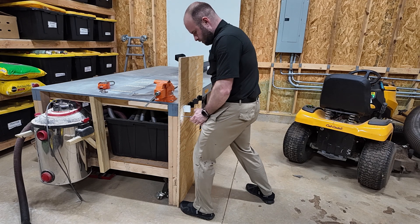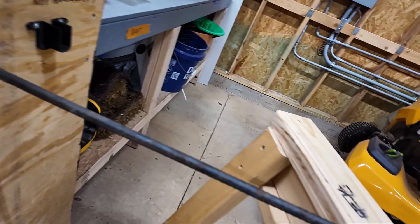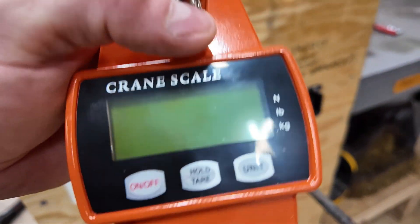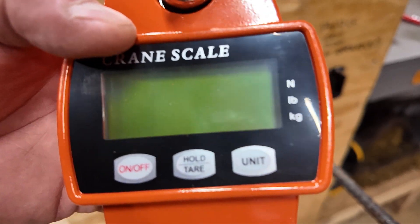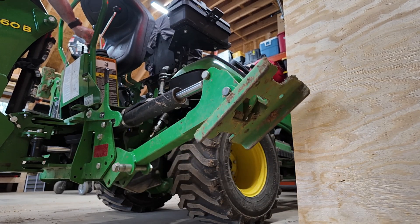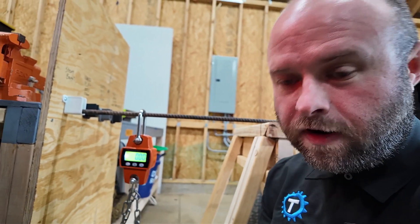Super scientific setup: I've got my little sawhorse here, I've got my samples, and I've got this piece of rebar on which the load will be placed. I take my little crane scale, place it on here, and then exert a pulling downward force to simulate a shelf pulling down on the bracket until it fails. We'll record this — it doesn't have a hold/freeze feature at the highest measurement, so we'll just hopefully capture it on camera. We're all chained up; I'll turn this on, record it, and isolate the moment it failed.